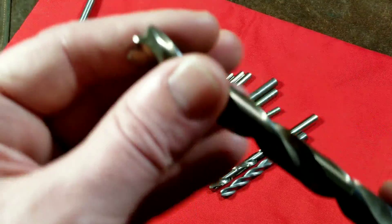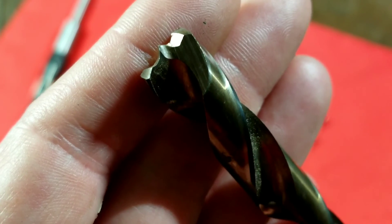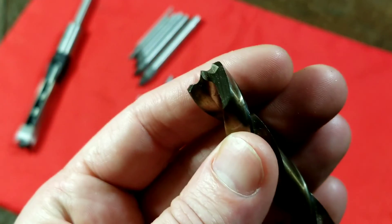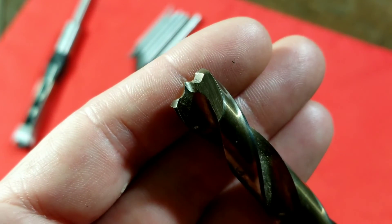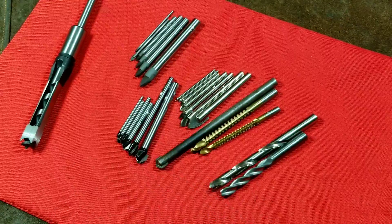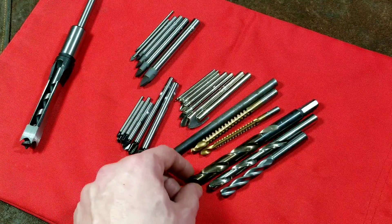I will do a little comparison of these. I only have a quarter-inch and a half-inch one. This is also Irwin — these are Turbo Point drill bits. DeWalt has a pilot point, but these are the next generation with a very sharp little pilot tip and a special grind. They tend to drill pretty fast and on-size. However, the issue with all these pilot points and turbo tips is that even though they work pretty well, as soon as they dull and you resharpen the drill bit, you're resharpening it back to a standard drill bit and lose all the advantage of those points. That's really why these types of bits have not sold well.